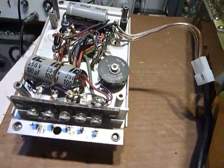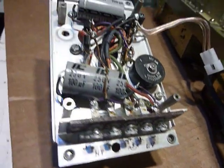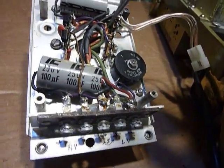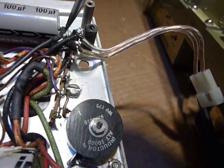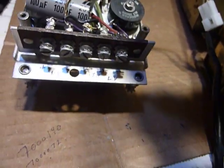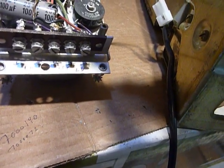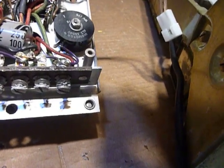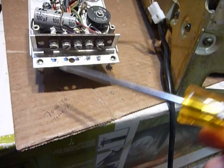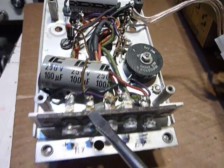So that was my problem — there was a short circuit in the power supply, and I'm glad I found it before I burned everything up. I wanted to show you this power supply. You've got this red-yellow lead here that comes out — that's your ground lead for your power transformer. And you've got the two capacitors. The thing I wanted to tell you about those is: on the BC348, you do not want those to go to chassis ground. You do not want the ground on the two capacitors and the ground on the transformer center tap to go to chassis ground. You bring those out to this screw right here — that's this brown wire right there.